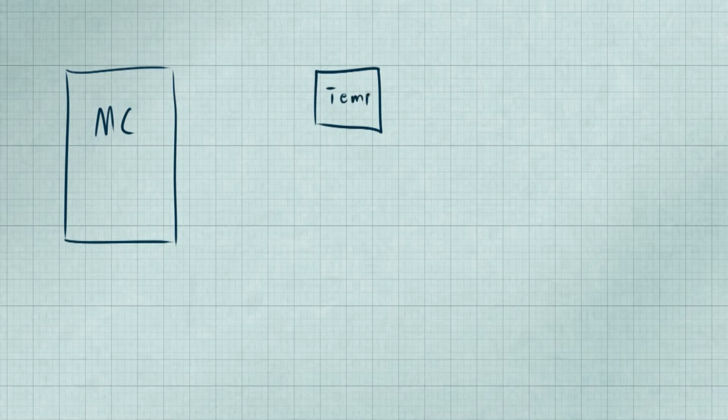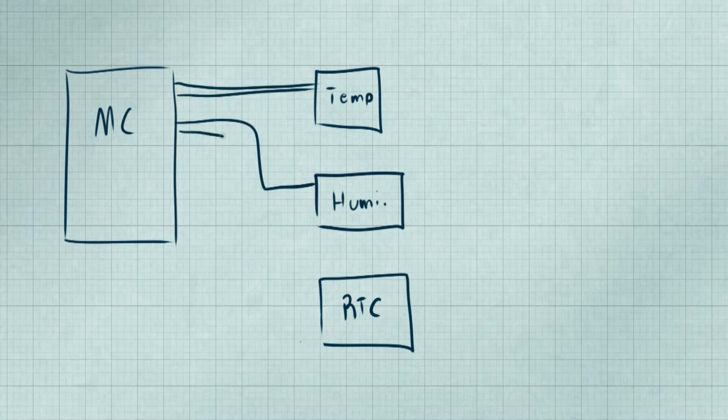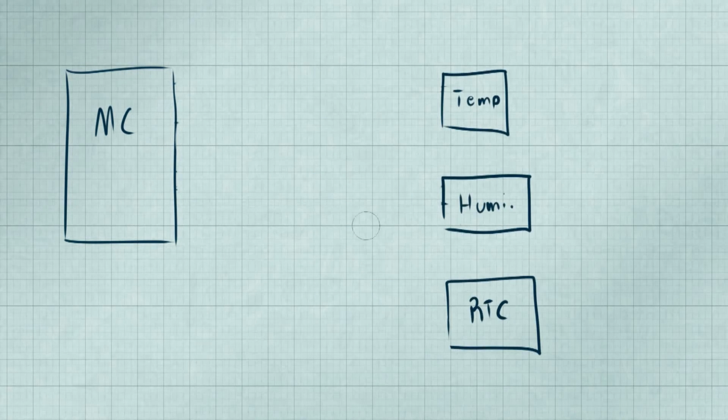So we have a solid serial protocol for talking between 2 chips, but what if we need to get more than just the temperature? Say we have a chip that knows the temperature, another for the humidity, and another for how bright it is outside our device. Now we could run 3 separate serial transmit and receive lines to all 3 devices, but we're running back into the problem we had with our parallel bus of having overkill and a mess of wires. This is where we can use an SPI bus.